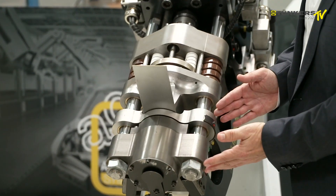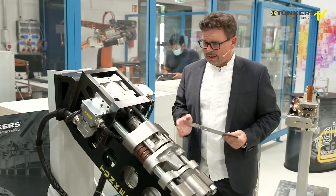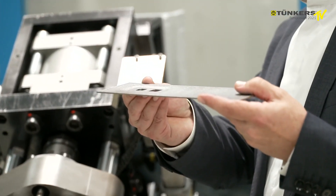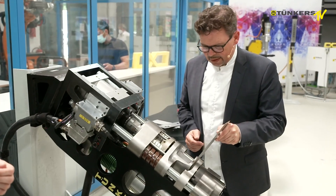You can see how the positioning cylinder is moved — an electro-hydraulic unit — and then we'll do the embossing at 30 tons. You can hardly see it in the sheet metal, so one millimeter may not be enough.